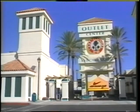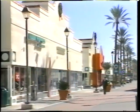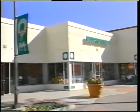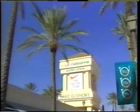We prefer fog coat at Prime Outlets Lake Elsinore much more so over paint. Fog coat is the best way to treat the color of your stucco. Fog coating lasts much longer than paint does. When you apply paint to stucco too often, what happens is you lose the texture of the surface. With fog coat, that doesn't happen because the product is actually part of the stucco. We would never paint our stucco buildings. We'll only continue to use fog coat on our stucco structures.